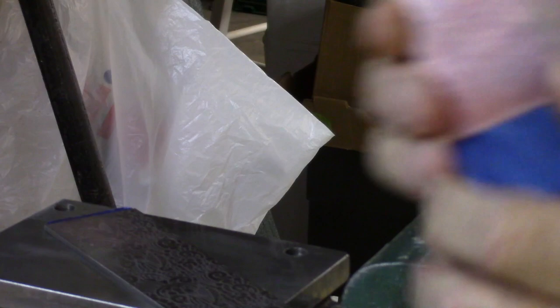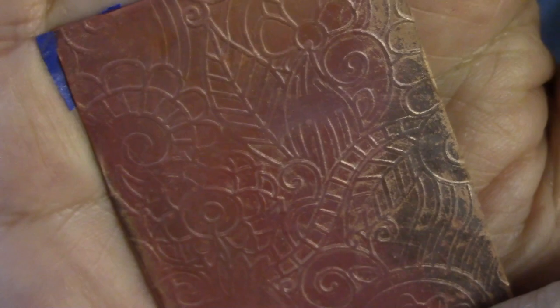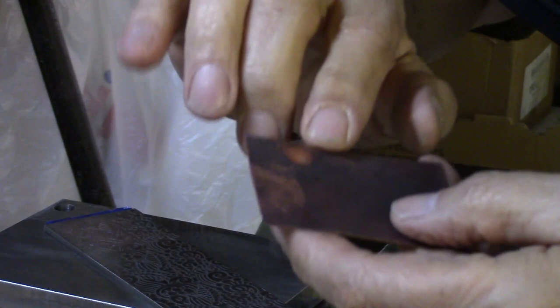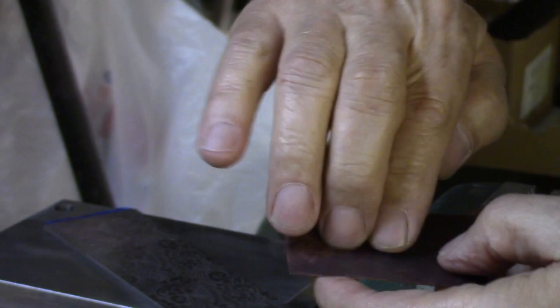You can see the pattern came out very good. Usually when you hammer the copper sheet you're working with, it will actually expand. So I start hammering in the center and just go outward from center out — this way I keep it even on all sides.